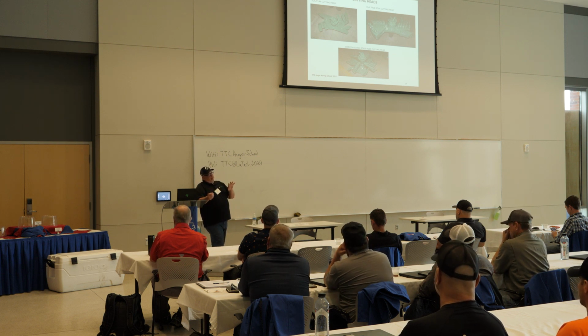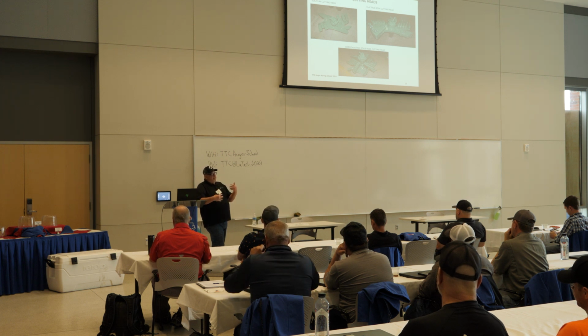And with that, you might not get water to the dry cone in the center because it sticks out farther. So that one's going to get hot. I recommend with a collapsible, if you pull it out, every 20 or every 40, pull the plugs, re-grease it to tighten the cutters back up. You're going to get more life out of the cutter.